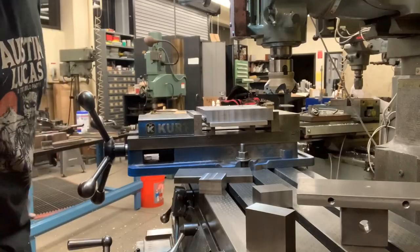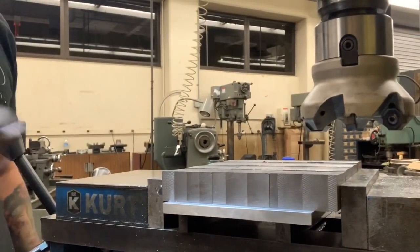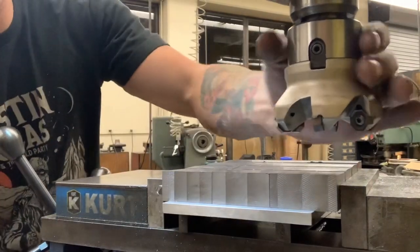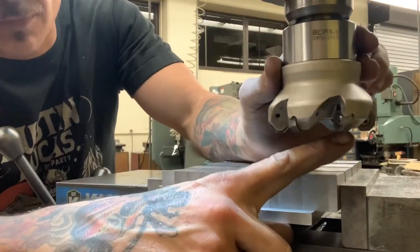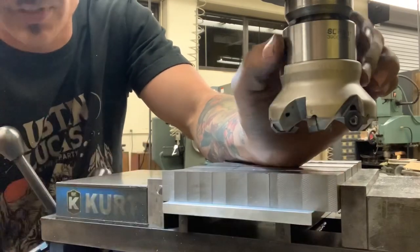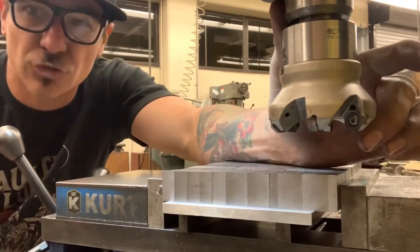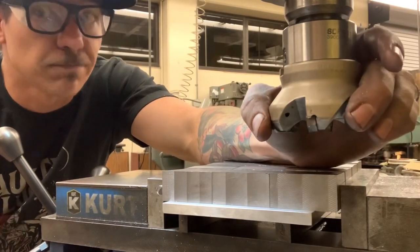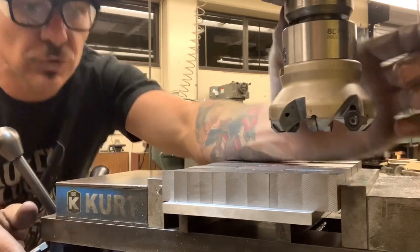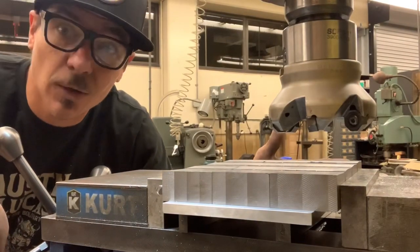Here's the fun part. I've got this big old face cutter — you can see all those octagonal inserts. The inserts are expensive but each octagonal insert has eight cutting edges, and you can flip them around, so really 16 cutting edges per insert — a lot of life out of them. They're more meant for harder milling like steel, so this will work out great. I'm going to come in and hopefully in one or two passes clean the whole thing up and have some tenons done.